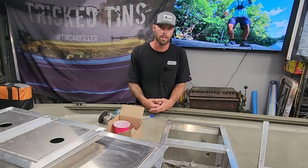Now, obviously I welded it. I did weld it up underneath here too, and those are some hard welds to do overhead inside of there. But same type of deal. If you can't weld, put a little angle clip in here, shoot them down to this face and recess them, and then shoot them into the side of this tube right here. It will support this deck. It's not that hard. It's very easy to do.